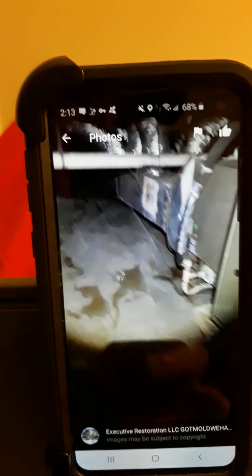The next photo is a historic home that had roof damage. And here is a photo of a leaky condensation line in the crawl space. So when you have leaky condensation lines and moisture in the crawl space that leaks onto the vapor barrier, make sure the vapor barrier doesn't have pools of water. Make sure they're dried out and you take care of the leak, because if you don't, it can create mold issues.